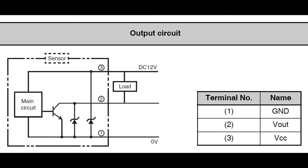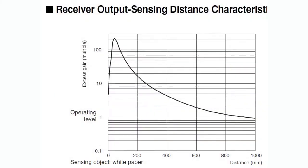For just an LED indicator, this would definitely be able to power that. On the sensing range: with white paper, you'll see it's good from zero to close to but not quite one meter. The reason they say 550 millimeters is because of the color and reflectivity. This sensor can apparently detect even clear materials, which is neat — some IR sensors don't work well with glass, but this can handle even transparent or translucent materials.